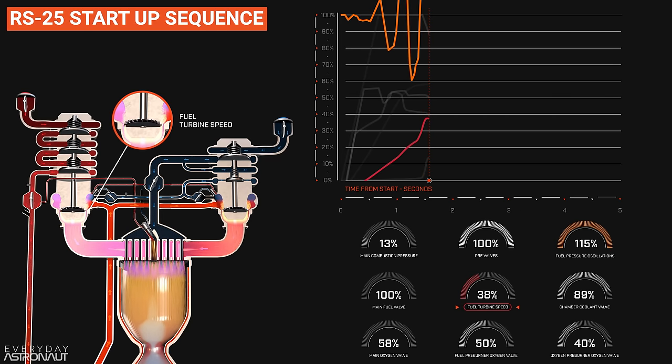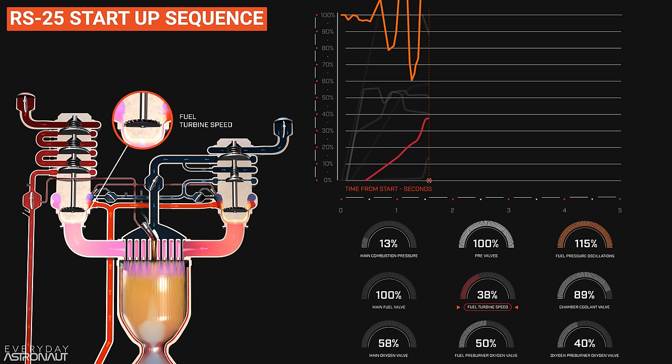In fact, every time you see the valve moving during this period, you can pretty much assume that there was an engine that blew up and changes had to be made from the lessons learned. By this point the pumps are spinning pretty quickly and the system is getting closer to reaching prime in all three chambers. At 1.25 seconds there's a speed check of the fuel pump turbine — it was found the pump needed to be above 4,600 RPM to continue forward into fuel preburner and main combustion chamber ignition, otherwise there wouldn't be enough hydrogen pressure to overcome the main combustion chamber pressure.